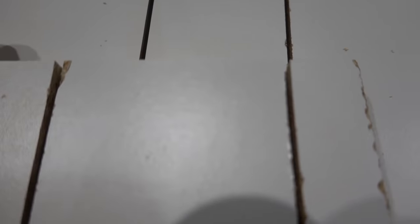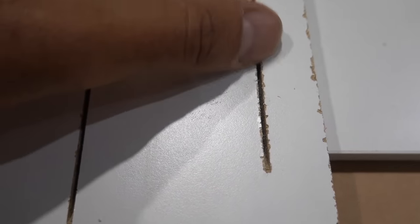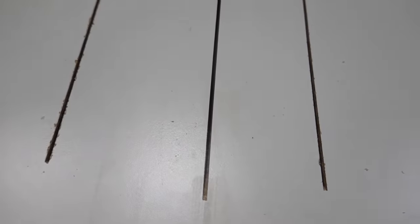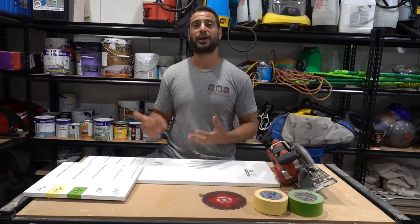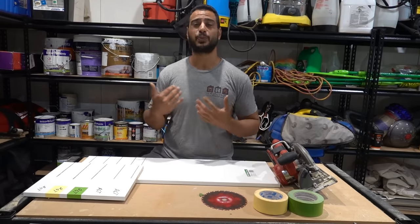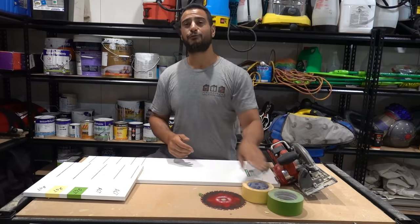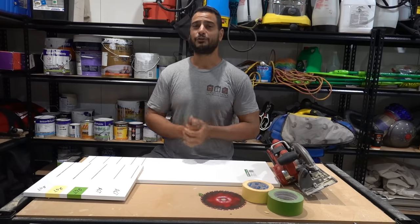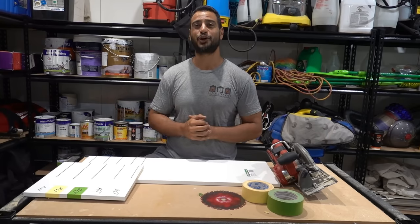Our last option was to compress a scrap piece of timber over the top - 24 teeth still had plenty of tear out, 60 teeth much better - but our winner is clearly 60 teeth with multiple cuts. That is our testing complete: 24 teeth versus 60 teeth across a whole range of methods including tape, added support, and multiple cuts. The clear winner was multiple cuts with the correct blade - using the correct tool for the job always makes a world of difference. When it comes to tape, we unfortunately didn't have much luck, which hopefully clears up that misconception. If you've got any feedback, put it in the comments below. Like, comment, and subscribe - until next time, I'm Bill, thanks for watching.